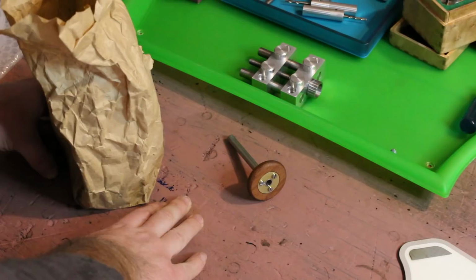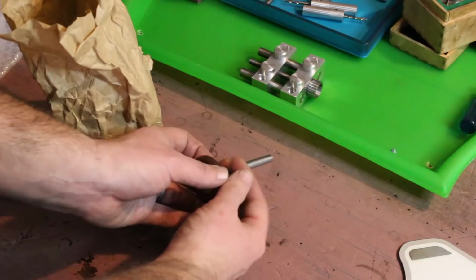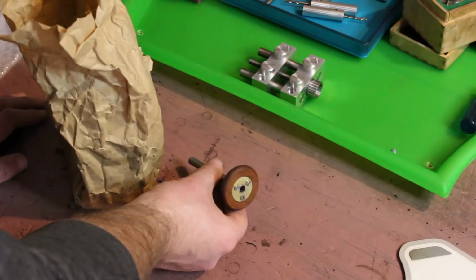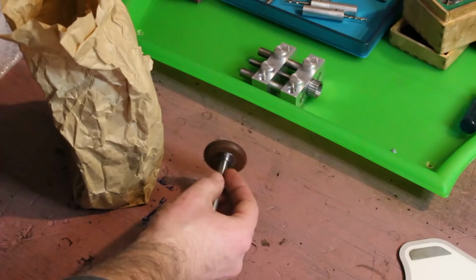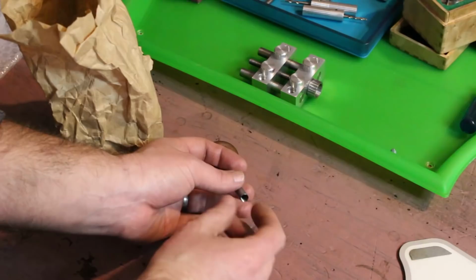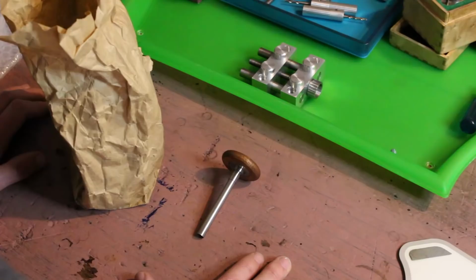Today we're going to make another one of these draw tubes. This is a little draw tube for the watchmaker's lathe to take the Webster Whitcomb style collets. The metric, I believe they're referred to as B8 collets, and the Webster Whitcomb collets are largely interchangeable except that the thread pitch that engages with the draw tube is 0.275 by 40 threads per inch for Webster Whitcomb, and the B8, I believe it's M7.